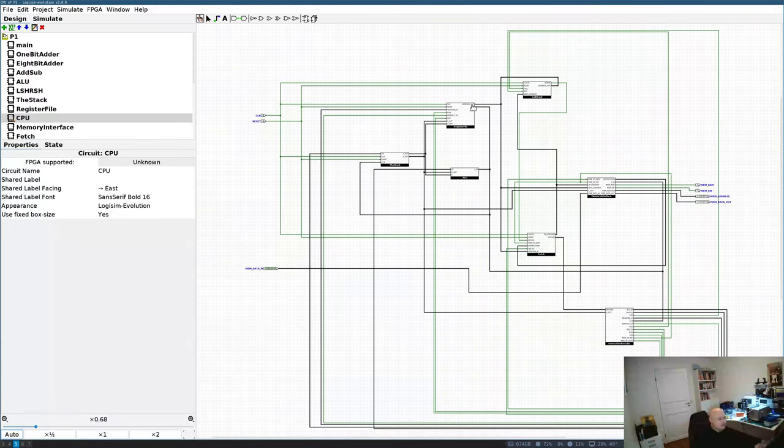What I plan to do is to implement each of those CPU modules — I have seven of them — on a separate PCB. Some of the modules will share the PCB because they're pretty small, like a memory interface. But the general idea is that each module will be a single PCB, and I would like to connect those PCBs using backplane connectors.